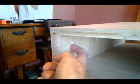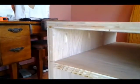I've used pocket screws to attach things primarily. I did nail in these center panels from the bottom. There again, if you look here, you can see the pocket holes I put in to attach things. It's a very easy, convenient way to attach things, and it makes them very tight. And you can put glue with it also to further secure it.